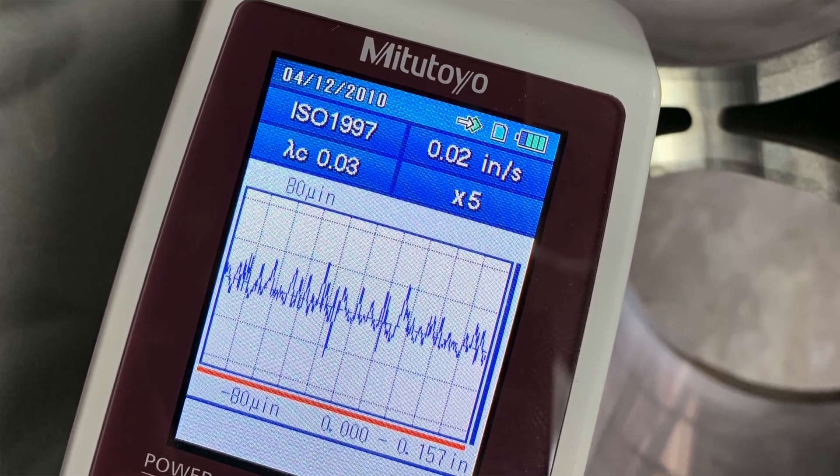We're talking about getting those surface finish numbers — and here's our profilometer. It tells you about the peaks, the valleys, the core roughness — all those things we need to support the load and retain the oil so that we have proper ring seal. With the previous fluid you were trying to hit those numbers — running this speed, this load — and you couldn't do it. You'd have to go back and forth, get it too fine, go back to rough, walking both sides of the fence to finally get all the numbers right to finish the block the way you want.